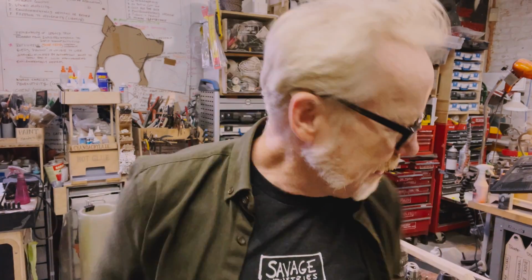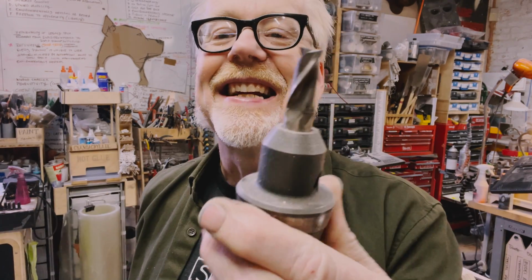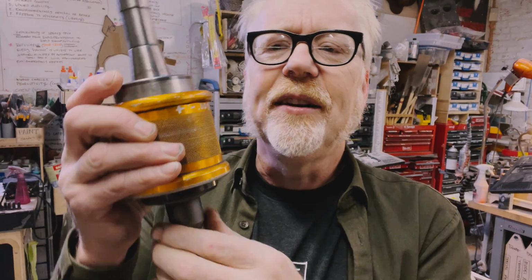One thing you should know about a tool like this is that while you can chuck an end mill into it, you don't want to. I threw an indicator on this yesterday, and its concentricity to the spindle of the mill is plus or minus about 3/1000ths of an inch, about 75 microns. That is fine for drilling holes for plate registrations. That is not an unreasonable amount of slop for exactly the operation that I'm doing.